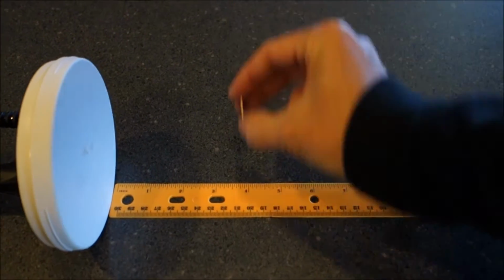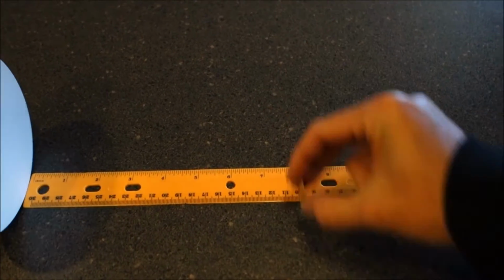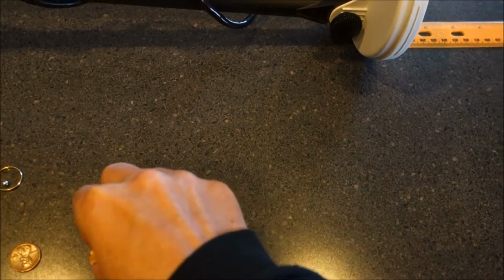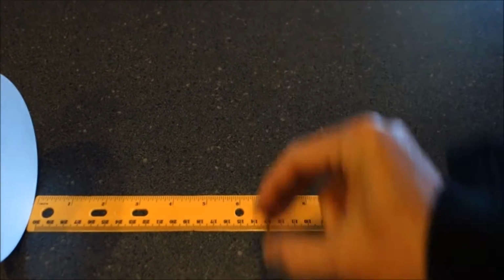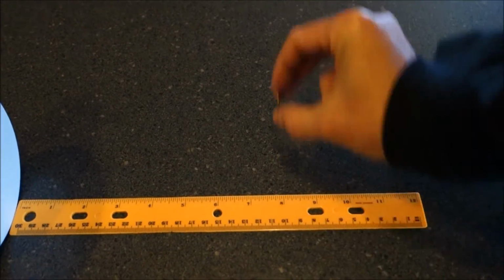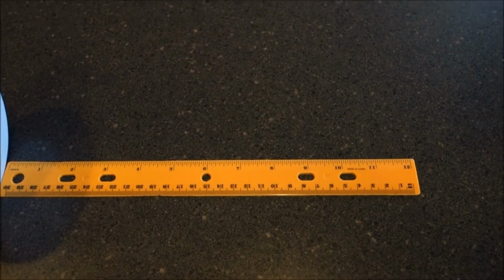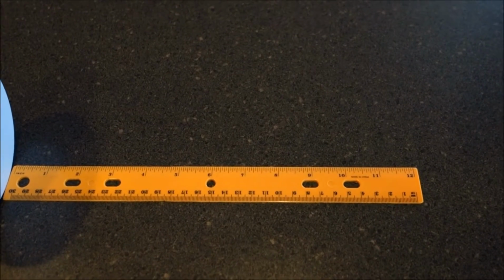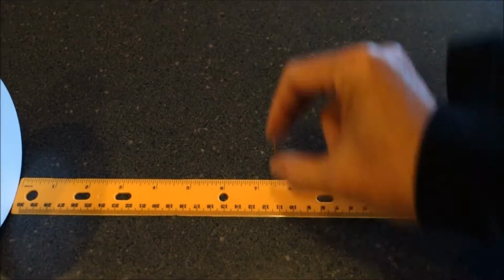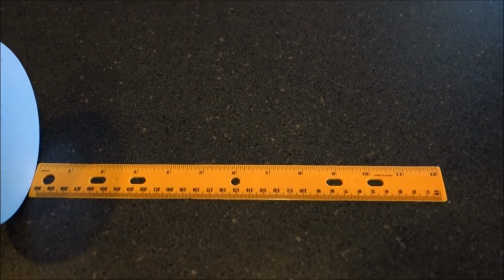Here's the dime. Definitely good at 7.5. Starts to cut off at 8. Zinc. Sounds like we're good, cleared about 8 inches or so. We're getting some falses. You hear it. But you can tell when I'm doing the coin compared to that. So we'll call that about 7.5, 8 as well. Seems to be the norm from our preliminary testing, 7.5, 8.